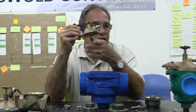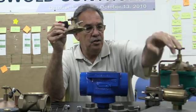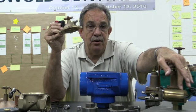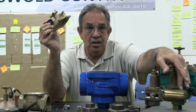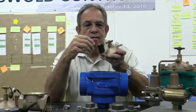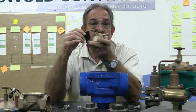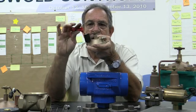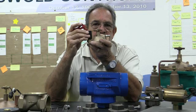Now we actually used to have a low power solenoid that was like 3 inches long. We no longer make this, and we haven't for the last, well, since I've been here, so at least I want to say 10 years. This was too costly. So what we've done is we've taken our low power solenoid and reduced it in size and also cost. So it's black with the 2 red wires on it. And your holding current on this particular solenoid is 0.075 amps.